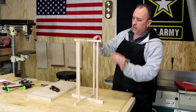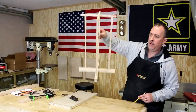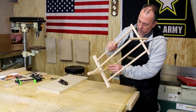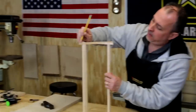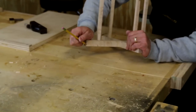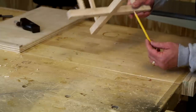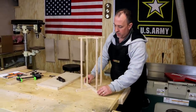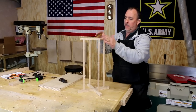After fitting the mortises and tenons on the top post, this is what the main lamp structure is going to look like. Everything holds together — this is all dry fit. Before we do a glue-up, there's a couple more things we have to do: drill a hole through the center, three-eighths of an inch for the lamp post cord. We also have to put a curved detail on the top rails and on the base. Then on the router table, we'll route out a section on all four feet to give it a little lift — feet touching the table with air space underneath, also a place for the cord. After that, we'll get on to making and cutting the veneers for the lampshade.